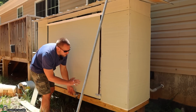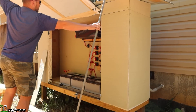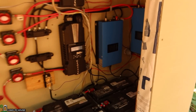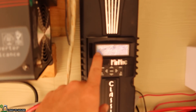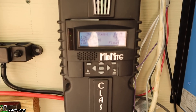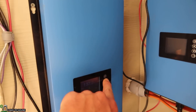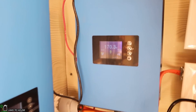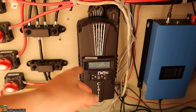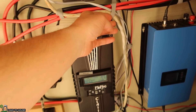I built this in the wintertime and the sun was not even close to it, but now that it's summer the sun is hitting the top of this full force. Here are the electronics I have — micro hydro coming into this classic right here and then solar coming into this one. Right now I've got about 220 watts coming in from hydro and about 200 from solar. The solar can do about 3,000 — I've seen it up to about 2,600 — and these inverters over here at 137 watts and 170 are feeding the house. When the hydro is not needed it's going to dissipate power here in the classic, and solar the same way, and it just gets hot. That one's definitely warm and the fans are running a lot.